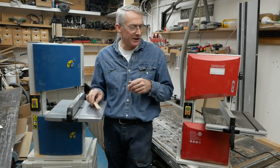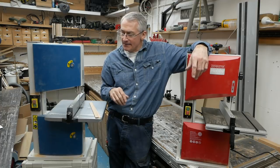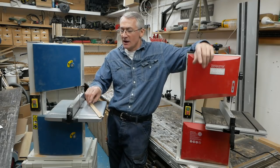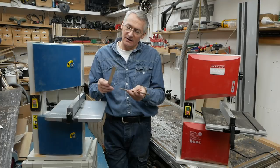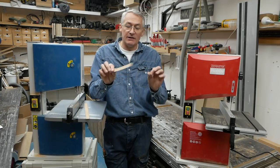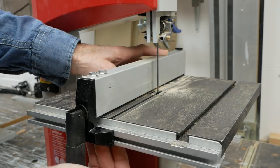In conclusion, let's have a little recap. Both saws are perfectly capable machines — surprisingly so in the Aldi's case for the money. The fence is a bit tinny and the table is all a bit wiggly wobbly, and yet it's done everything I've thrown at it for six months or more. Not quite capable of getting as thin a cut as the Axminster, but then the blade is six months old and has been horribly abused. The Axminster gives a lovely thin, almost veneer sort of cut, as you'd expect from the cast iron table and a much more solid fence system.